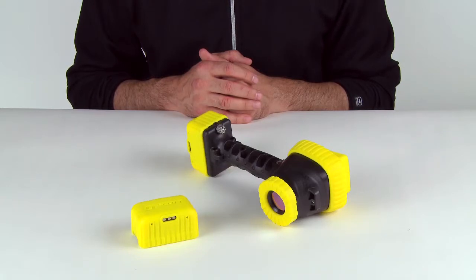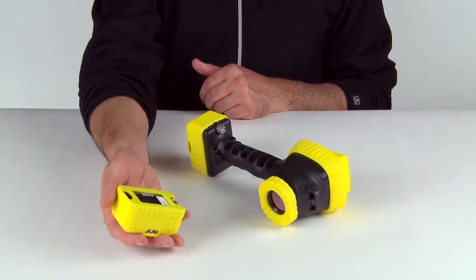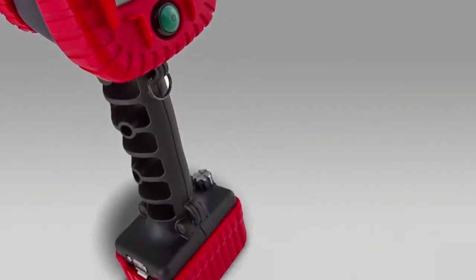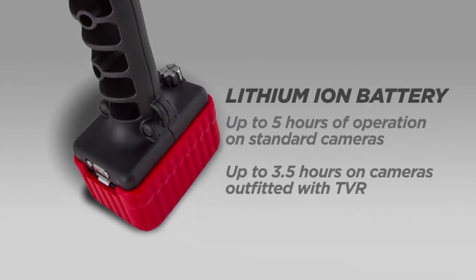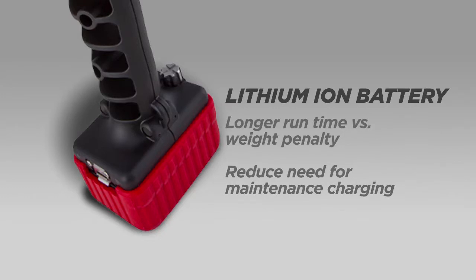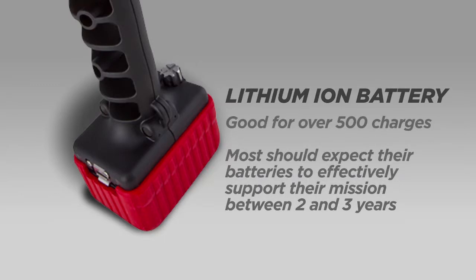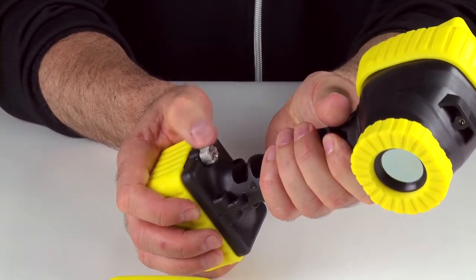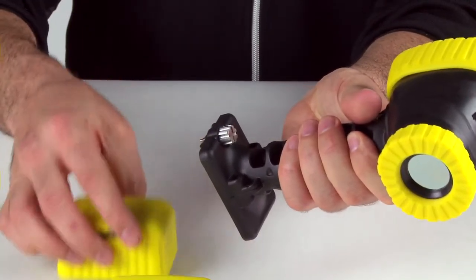All components were designed to be effective, lightweight, and easy to use. The battery is just six ounces and provides some of the longest duration in the market. The lithium ion battery provides up to five hours of operation on standard cameras, or three and a half hours on cameras outfitted with TVR, thermal video recorder. The benefits of lithium ion are longer run time versus weight penalty and reduced need for maintenance charging. Lithium ion batteries are good for over 500 charges, and most customers should expect their batteries to effectively support their mission between two and three years.